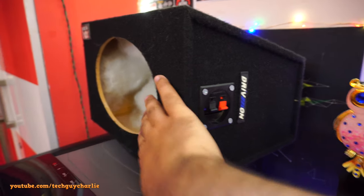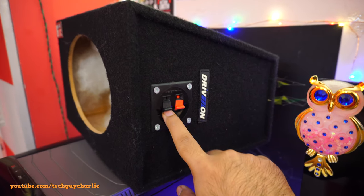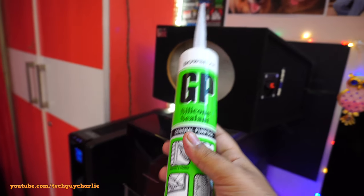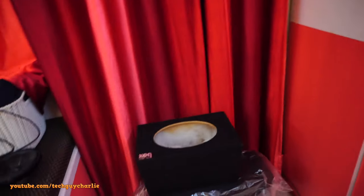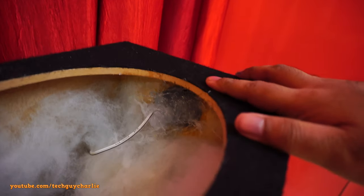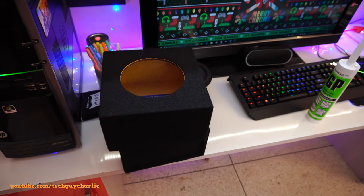Here's another update. The terminal box was leaking air, so I held the speaker over the box and played some tunes to check for leaks — and turns out this part inside was leaking air. I ordered some silicone sealant and sealed the terminal box from the inside. There's quite a bit of silicone on it. The silicone has cured, I tested it again, and there's no more air leakage — the box is now completely airtight. The other box still has slightly more sealant and is still drying.